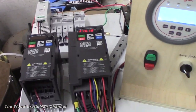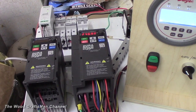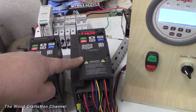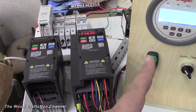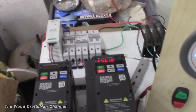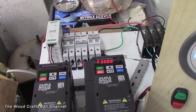They don't derate the drives. If you go past single-phase input and need larger horsepower, you basically have to double the size of the drive for the horsepower you're driving. This setup with the Digihelic is actually considered a PID system — all it does is modulate the VFD based on what the Digihelic says the static pressure is supposed to be.